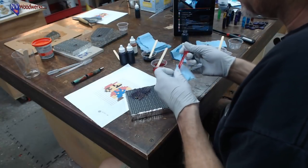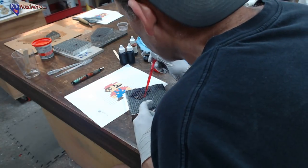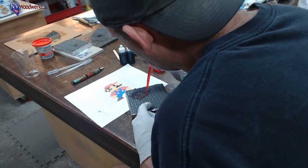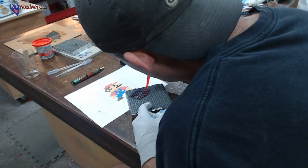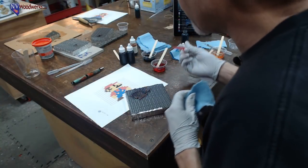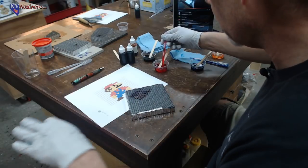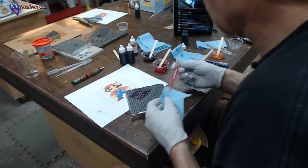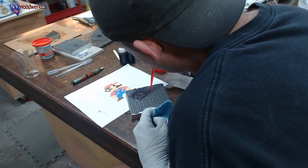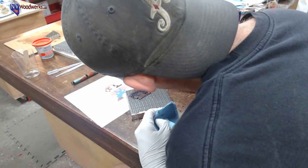And you can use these pipettes to add resin, if you're making pen blanks and want to get color in very specific places. This is a good way to direct color into a brick or a blank in specific places. Now you still have somewhat limited control over what you actually are going to get. It's still liquid resin, so there are limits on the amount of control, but you can put it in very specific locations in your casting. A lot better than just dumping color in.